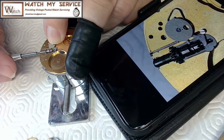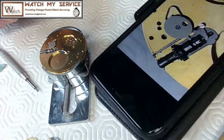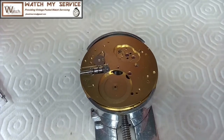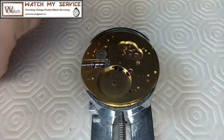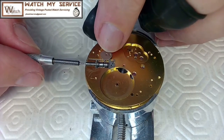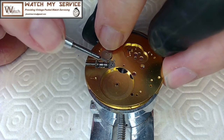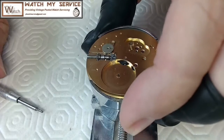Try that again. It's in like that, then it'll move the lower wheel like that. Okay, so that works. Let me get a close-up and show you how that works. When I press down you see it connects the clutch right here. When I let it go it allows this wheel to move forward, and these gears here are connecting with the gear on the bottom which is moving stuff on the other side of the watch. That's the way to do it.